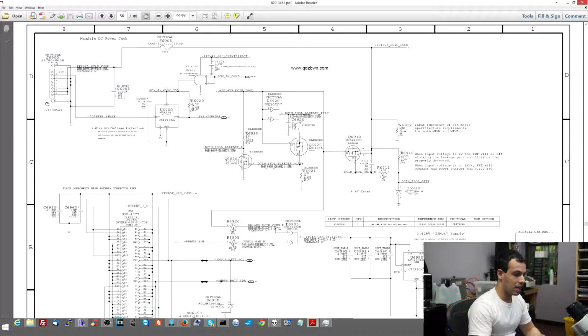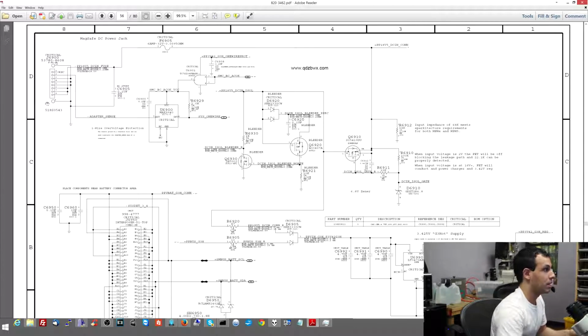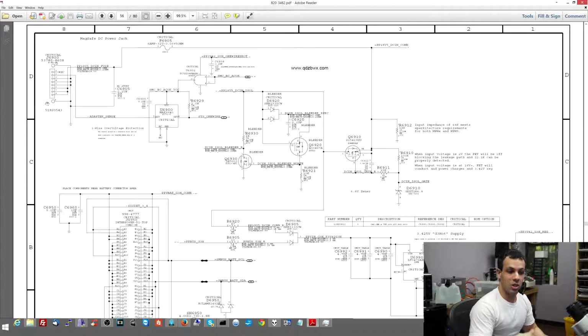I don't want to explain exactly how the one-wire circuit works in this video, so I'll encourage you to look at a video entitled "What is the one-wire circuit and what is its purpose?" I've talked about the one-wire circuit in many other videos. Feel free to search through my channel. Again, it's not a paid video. It's a free video, so you can learn for free. You need PP3V42_G3 hot to have the one-wire circuit working.